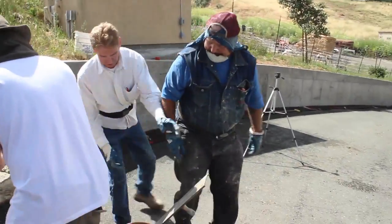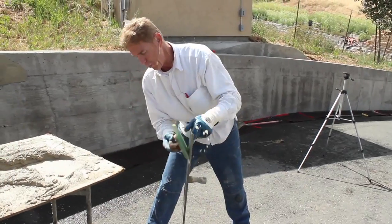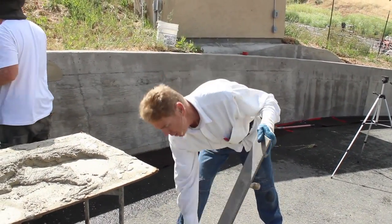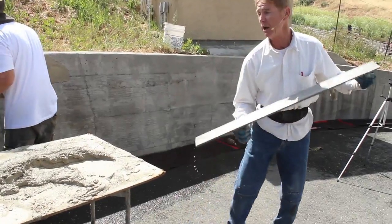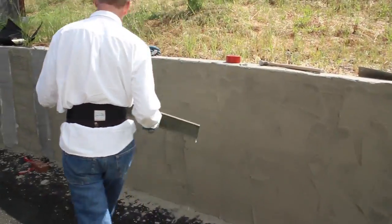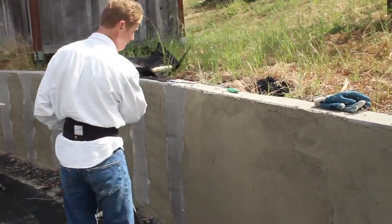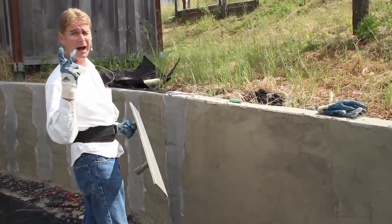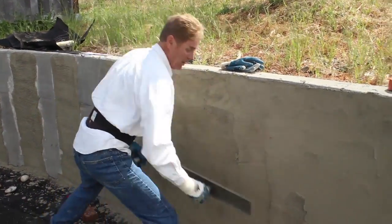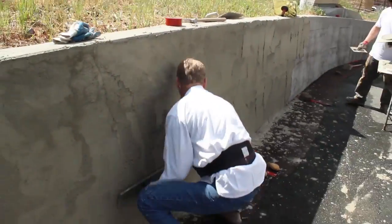Excuse me, guys. We wet the darby. A dry darby won't do anything except pull the stucco off the wall. So always wet your darby. Never use a dry darby. Don't do that. Okay, here's what I do now. Now we're starting here. I'm going to have to let this set another half hour, 15 minutes, because we have two bags of retardant in this. Now, basically what I'm doing is pulling it up.